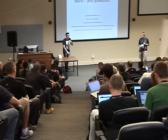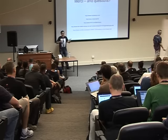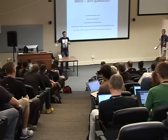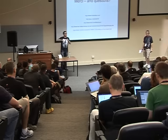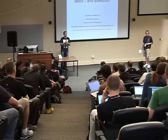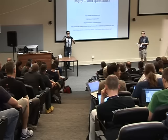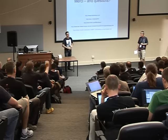The question was about reverse engineering the backlight and how to turn it on and off and dim it. The backlight's not as smart as you see from the software side, so all of that setup with I2C and GPIO is done on the motherboard, it seems. Most laptops will have just power and an enable signal, and you PWM the enable signal going in. It's not a smart device that you're sending I2C transactions to. So that's fairly easy. You've got 12 volts, ground, 5 volts, and something that's a square wave or fully on. But that's another thing that you have to reverse engineer.